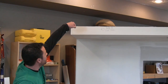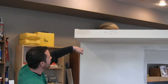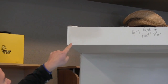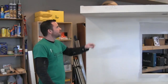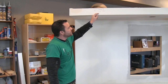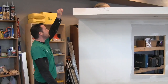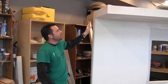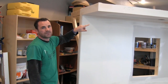If you remember we dragged this down, then came this way, and then I did another layer down — you can see how it's actually filled it a little bit more. We just want to prevent being able to see that corner bead, because if you don't fill this good enough you'll see that little metal piece in the bead — about three-quarters of an inch of it. So you want to fill these up lots. I did both those sides and touched up this corner a little bit. Now this whole little side is ready for a skim coat.